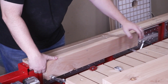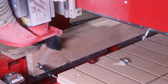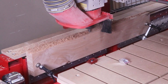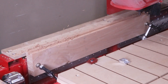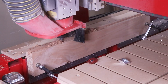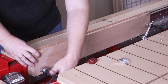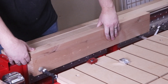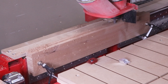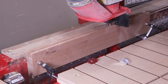The last rail is the center rail, so we need to apply the dado on both edges before proceeding. All the stiles and rails are made out of what is called LVL laminate material, finished with hardwood around the outer edges of the glued-up laminates. I was able to find a local supplier that sold these five-inch wide LVL stiles, 88 and 98 inches long, at between $65 and $75 a piece. This structure makes the door extremely rigid and will last a long time with minimum warping or twisting.